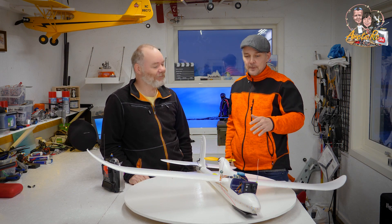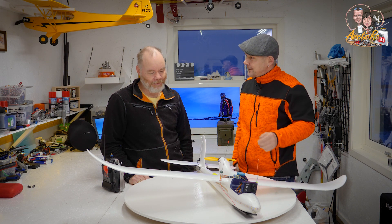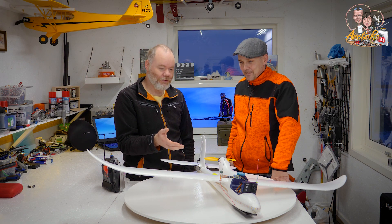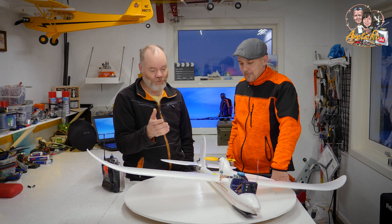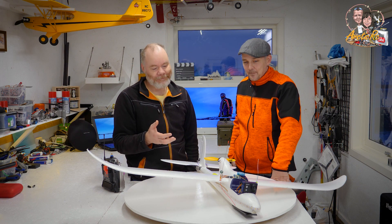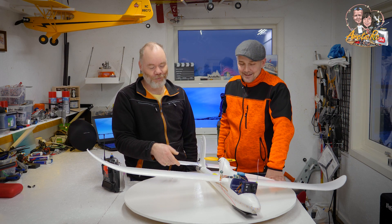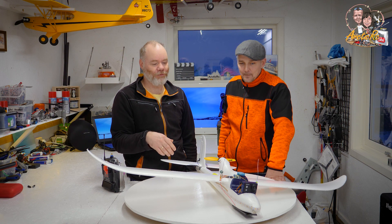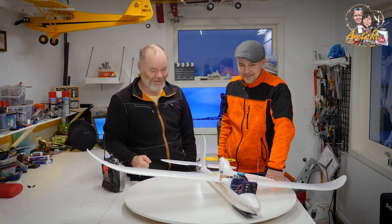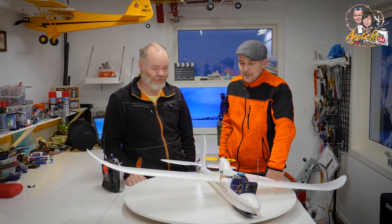You've also set it up with a GPS, a camera, and a long-range receiver. I was going to just start using it a little bit, so you said you have to mount some lights and do some Christmas flying. I mounted some lights. I like technology so I put in a flight controller — an Omnibus F4 — and installed ArduPlane on it. And of course I have to have GPS and telemetry. So it's not beautiful but it's functional.